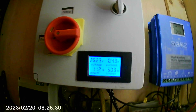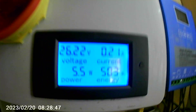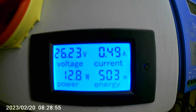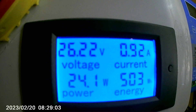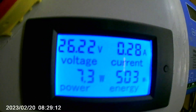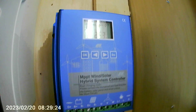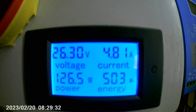The problem with the bridge rectifier is it's like putting the brakes on — it's flash charging. It would charge and then completely drop off to nothing. That's PWM — pulse width modulation — it would kill the RPMs from the turbine. You can see in the bottom right corner it shows 503 watt-hours logged. In those five days with the bridge rectifier, I created 240 watt-hours. I then hooked up the MPPT controller two days ago, and in just eight hours it produced a little more than the bridge rectifier did in roughly five days with higher winds.